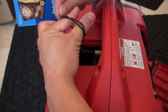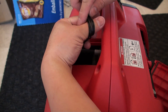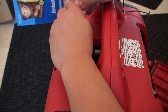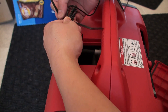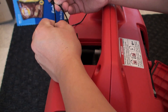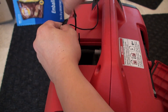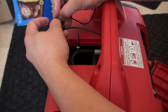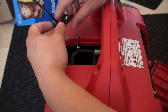Go ahead and coil up the excess pickup wire, leaving about 12 inches remaining on the end so that we can fish it through to the other side of the generator. Then using a zip strap, go ahead and tie it together. Note that this second zip strap does not come with the hour meter, so you'll need to use a garbage bag tie or something similar — they're inexpensive.